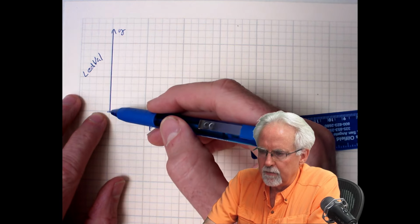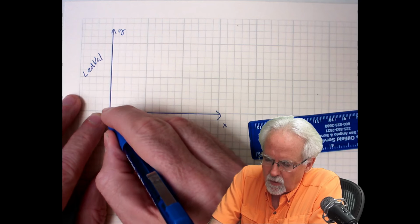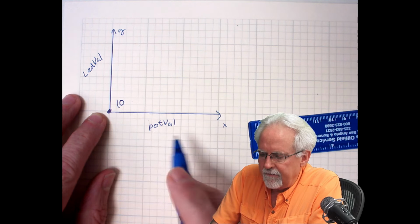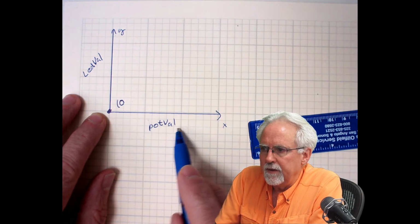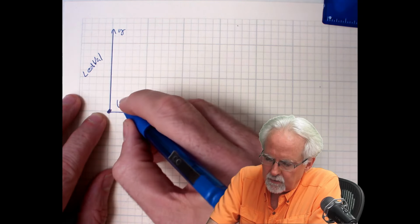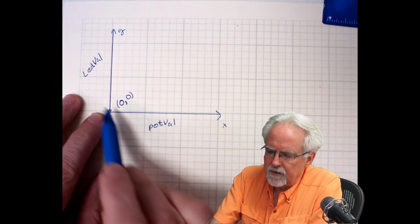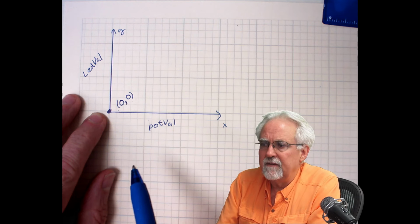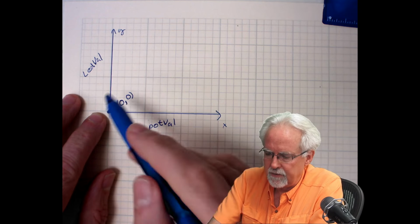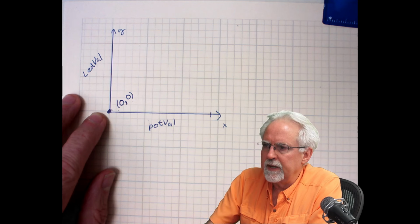All right. So the pot val is going to go between 0 and 1023, and then we want to turn that into a number between 0 and 255. So let's think, what is our first point? If you read a value of 0 on the potentiometer, what value do you want to put on the LED? Well, you want to put 0. That one is easy. 0 pot val turns into 0 on the LED val, because if pot val is 0, you want the LED to be off, so you want to write a 0. Okay, that one's easy. Now the next one is out here at 1023.